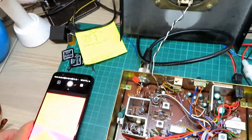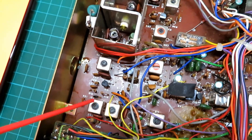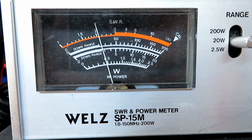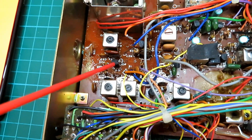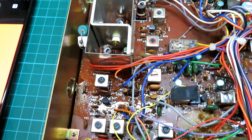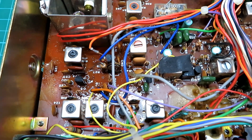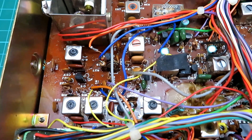We'll put the thermal camera down and get some spray and just hit that. Look, there you go — the power's popped back up! And we can see it's that transistor there, Q5. Eventually when it gets hot again the power will roll off, so I'm pretty sure that's our dodgy component. Let's take that out, test it, put another one in and see if that fixes the problem.